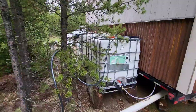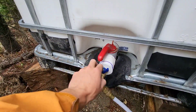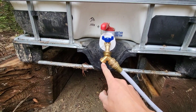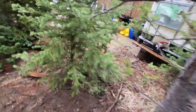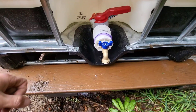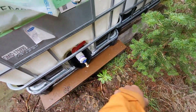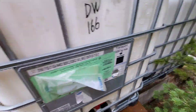So these are the two IBC tanks and this is where they're going to live. It's kind of redundant to have two valves, but a quarter-turn is way easier than the big one. You can imagine another female-to-female on this side, and then that will go over to the other tank which is coming off at the side here. If you think of a garden hose — you have a male and female end — you put the female end on there, open the tank up, and that male end hooks to the female-to-female adapter. I just need probably a ten-foot hose to get over to that other side and I'll be able to use the second tank.